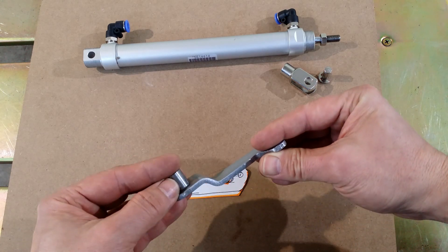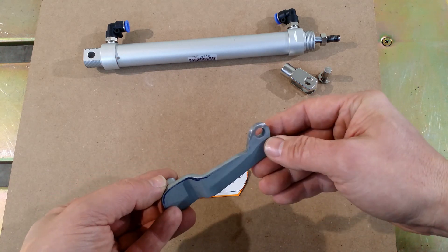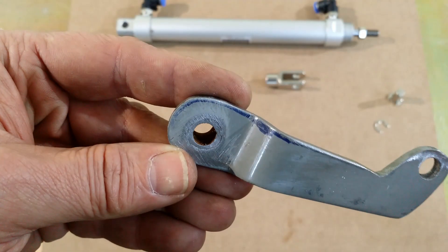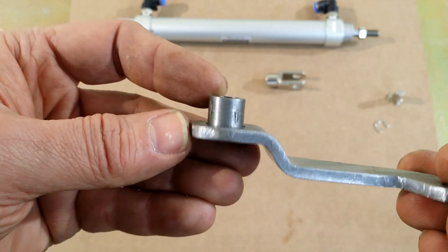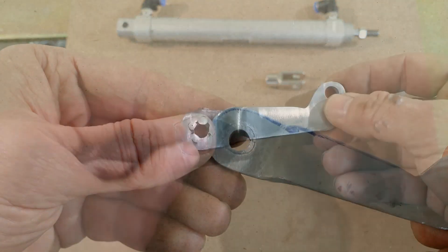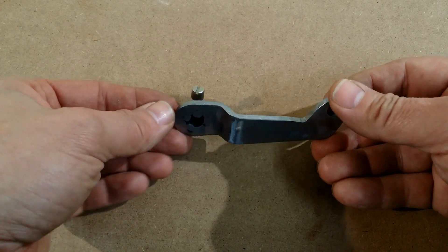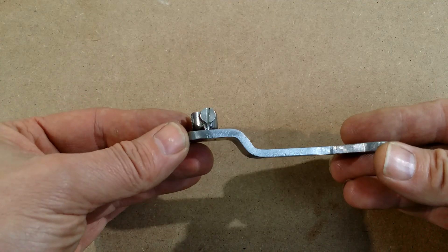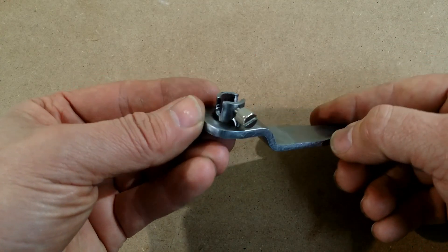The sleeve will be on this side. The hole is drilled and the sleeve pushed in. I tack welded it at 4 points here and 2 on the back. Slots are cut on the sleeve and a tiny hole threaded for the set screw.